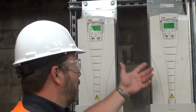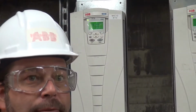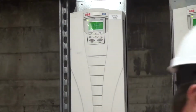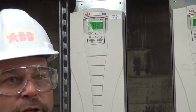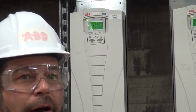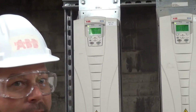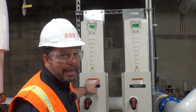As far as operating these things, there's not much for you to do from a maintenance perspective. Inside here, and I'll leave these with you guys. I'll leave these with you, Sam. Those are basically operation and maintenance manuals. The two things to key on for maintenance: one, inside here, tightening up the line voltage lugs, right? Making sure that the connections are tight.